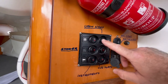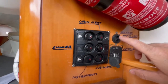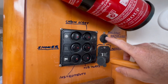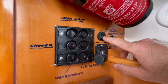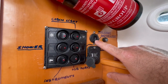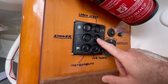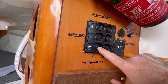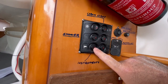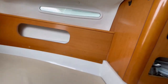When you want to start the cabin light, you have to press this switch to the right side and press this switch on the light itself. When you want to start the navigation light on the top of the mast — the tricolor light, red, green, and white — you have to press this switch up. If you want to start the anchor light, put this switch in position 2 and now we have 360-degree white light on the top of the mast. This switch here is for autopilot; this switch starts the two USB ports; and this one starts the instruments. We have instruments in the cockpit: wind speed and direction, depth meter, and speed through the water. This switch here starts the cockpit shower.